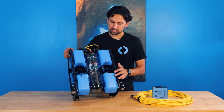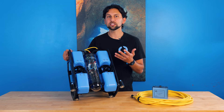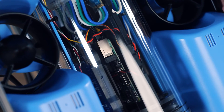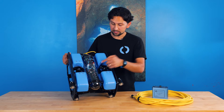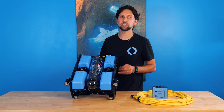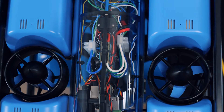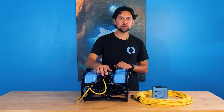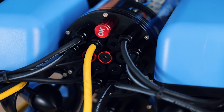Behind that are the rest of the electronics. There's a flight controller, which has sensors on board to determine attitude and heading, and outputs to the thrusters to automatically stabilize and control the vehicle based on pilot inputs. Next to that is a Raspberry Pi computer, which connects to the ethernet network that links the vehicle to the surface and forwards video and control data up to the topside computer. That's connected to the Fathom X tether interface board, which transforms that ethernet connection into a long-range connection over just two wires. At the back, there are six speed controllers that connect to the thrusters and to the power from the battery. On the back of this enclosure are cable penetrations leading to the thrusters and the lights, as well as a pressure and temperature sensor, a vent, and several blank penetrators for expansion.